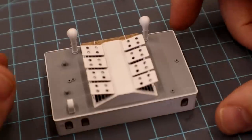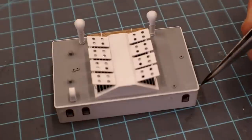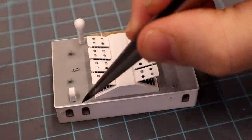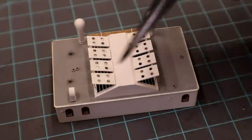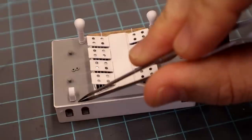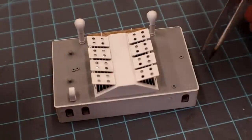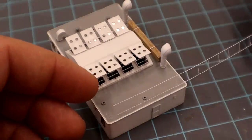Once you're ready to apply your railing, determine where it's going to go. This piece is going to start in this corner, go straight, hang a left, make another short left, and end up right here. I'd rather start in this corner and go this way — knowing I'll start here and have a little extra, or end up just slightly short and cut it off — versus starting at the other end and coming up way short altogether.